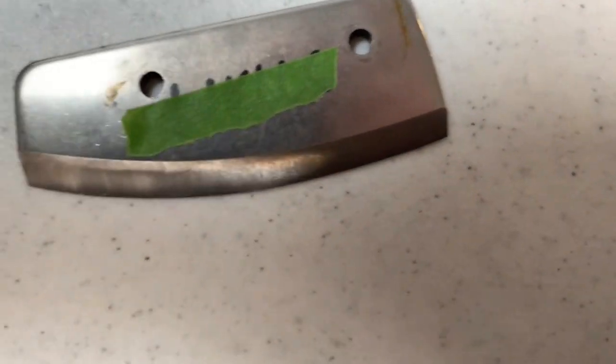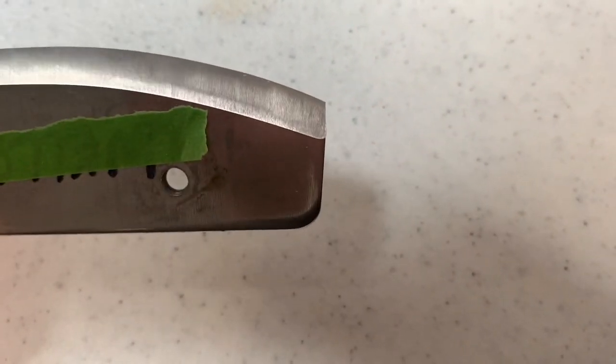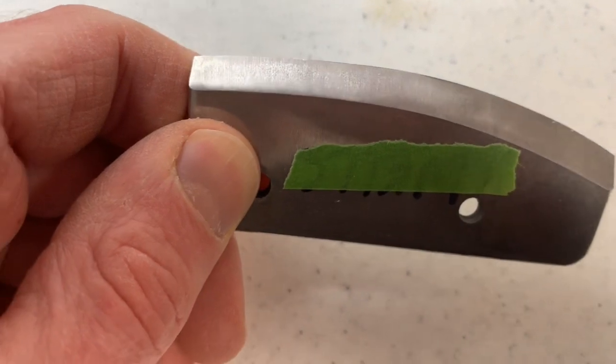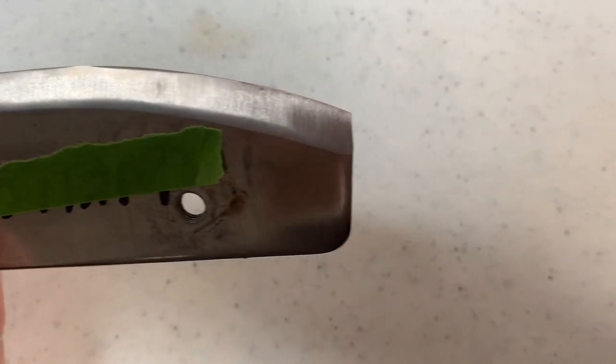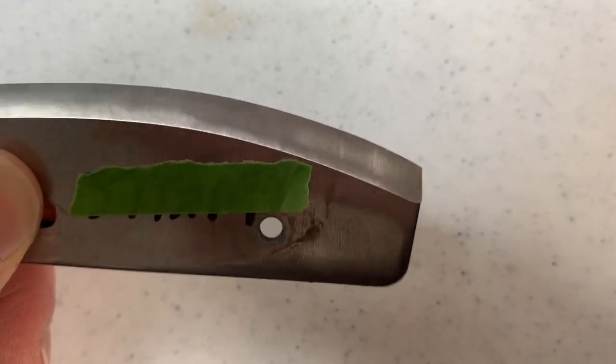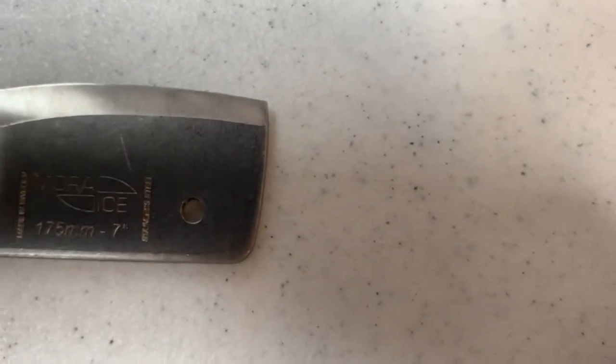This is one that I just did for a customer. Can we get it to glare? So now — inconsistencies you see in my work in the glare — these weren't that dull. There were some spots where the original sharpening didn't need a lot of work. Let's look at the backside on this. There's no counter-grind or whatever — if you see what looks like a little something there, let me explain that. There is no counter grind. It's just cleaning up the burr that came from the front.